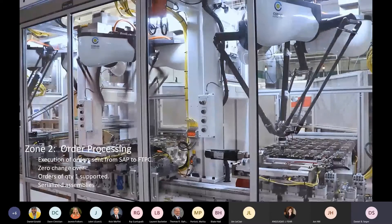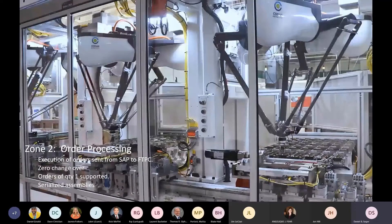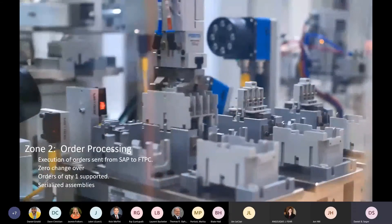There's an extensive use of robotics and an extensive use of vision technology. This allows us to have flexibility around the diversity of assembly requirements — going from one model to another, we may pick the same component but place it differently, or retrieve a different component entirely. Vision systems verify that we're picking and placing things properly and ensuring overall assembly quality. Should anything fail, because of the iTrack technology we can bypass those sequence stations and carry the incomplete unit to a reject station, where it can be removed, reworked, and returned into the system to continue its assembly process.